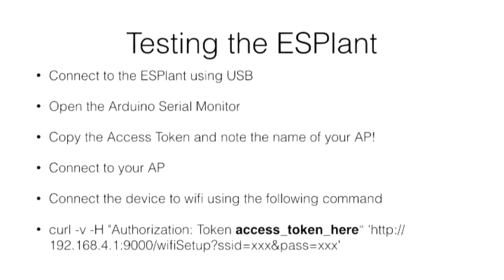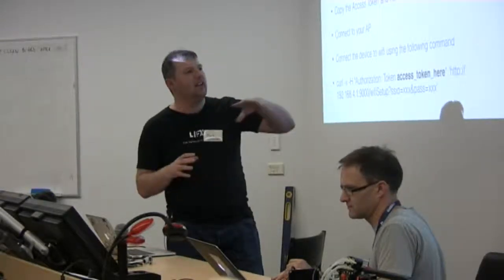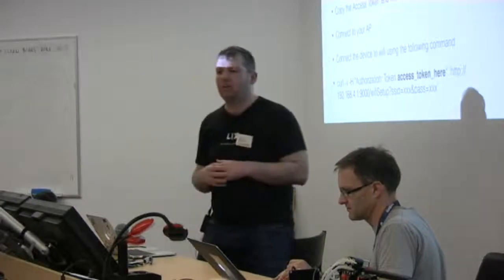What I wanted to do with the firmware was — a lot of the examples that come with the ESP environment have effectively hard-coded Wi-Fi credentials. So many times I've seen Wi-Fi credentials in Git and stuff like that. So what I wanted to do is just do the most minimal setup to get something where we save the credentials onto the device. In the actual firmware, there's something called ESP onboarding — that's a small library I've written, it's open-source on my GitHub.